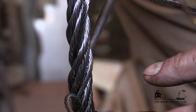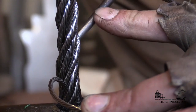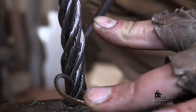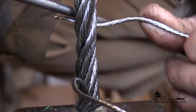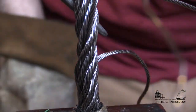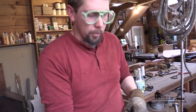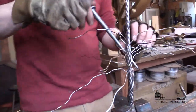I'll pick this up right now and get the spike in here. The other thing you've got to watch out for — you can just sort of see I'm picking up a piece of the core in there. You don't want to do that. I'm going to stay away from that and get my spike in nice and clean. We'll tuck this — you can see how it's untwisting nicely. Now I lay that in — that tuck just almost disappears right there. That's really sweet, that's what it wants to do. That's pretty much textbook right there.